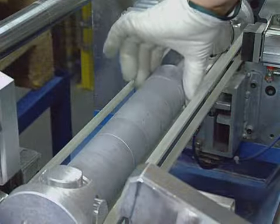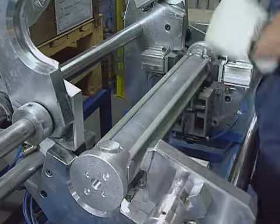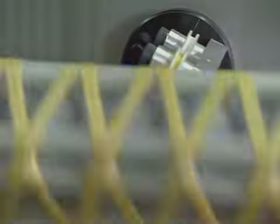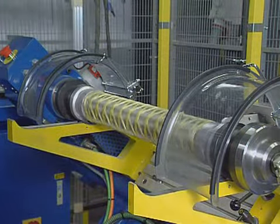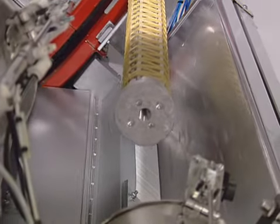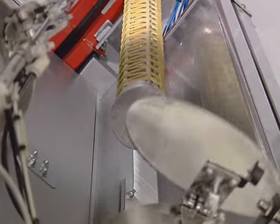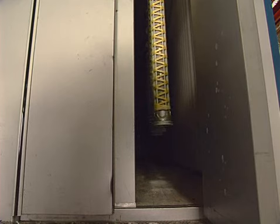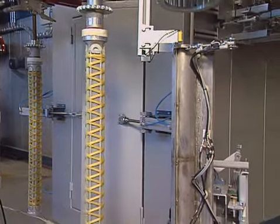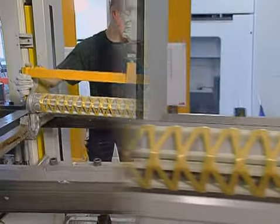During assembly of the PEX-Lim arrestor, the column of blocks is secured with glass fiber loops, giving it good mechanical properties. Aramide fibers are wound around the column of blocks to provide maximum safety in the event of a short circuit. A process follows in which the interior is primed in order to obtain good adhesion during molding. The method is completely free of environmentally harmful substances and thus follows ABB's environmental policy. After drying, the interior is heated in an oven before final molding.